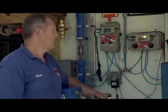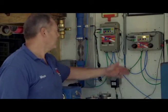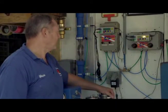Here in our area of Florida, with the caves that we dive and the various things that we do, somewhere between 30 to 32% is our preferred mix. And so we would dial in, here at Amigos we use 32%. So we would dial in here until we have the mix that we're looking for, and the needle valves, or the other box that we also have here has actually pressure regulators on it, small regulators, can dial into tenths of a percent.